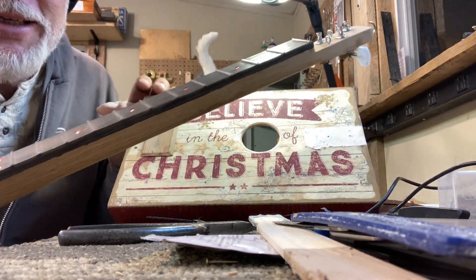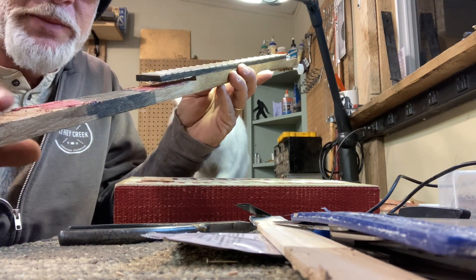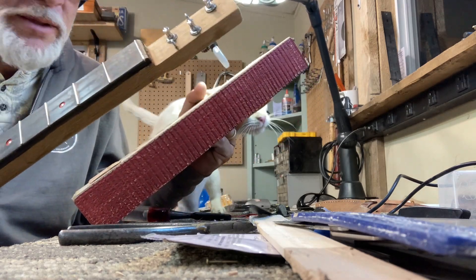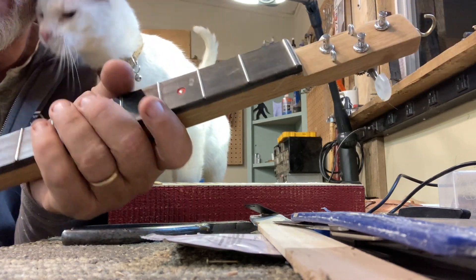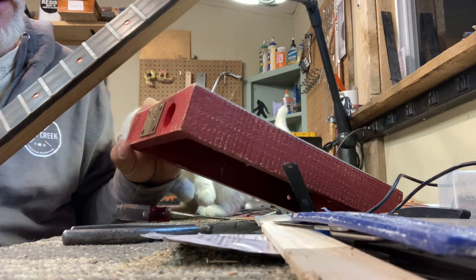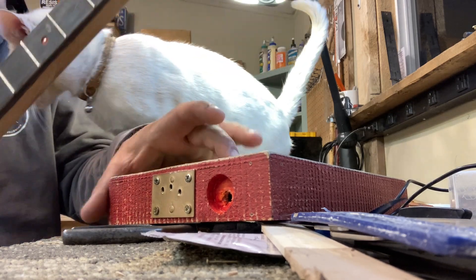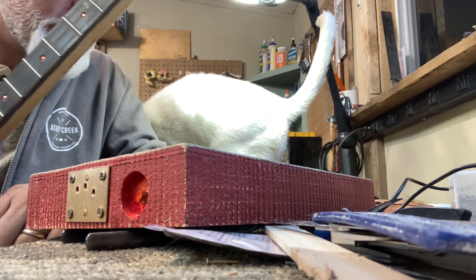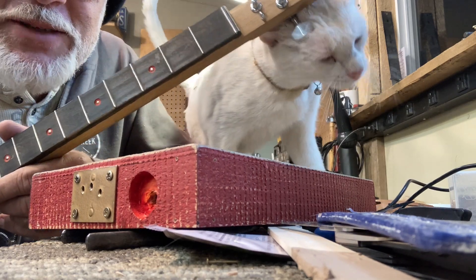Next project is to rebuild this guy. What I think I'm going to do is find some oak, make a heel, give it a back angle, and I'm thinking maybe I'll just put a single coil pickup right in this sound hole and keep it simple. I will re-carve this neck because it's kind of square - I want to get it at least curvy. I'll leave everything else original. I know there's a piezo underneath here because I can see the black wire leading to it, but I'm going to go with a single coil instead. We'll see you guys in the next video - cheers!